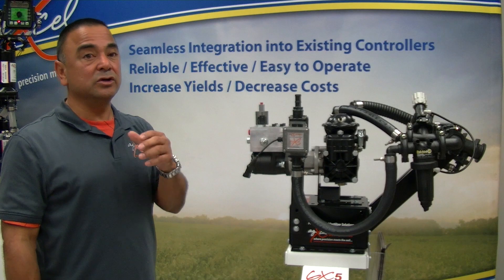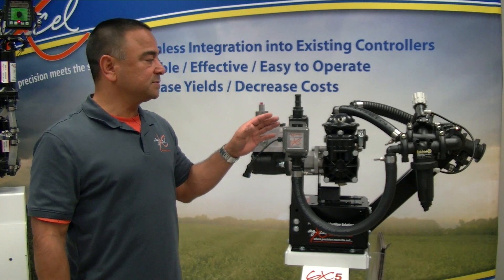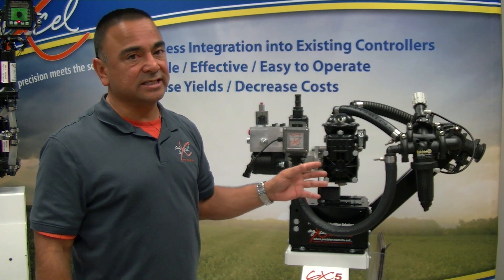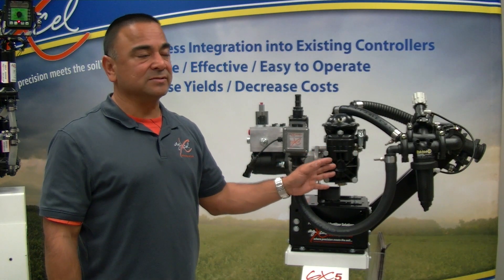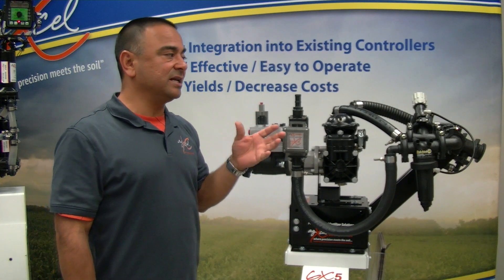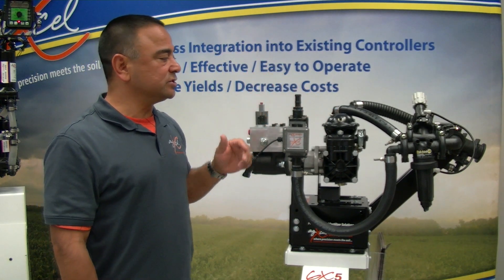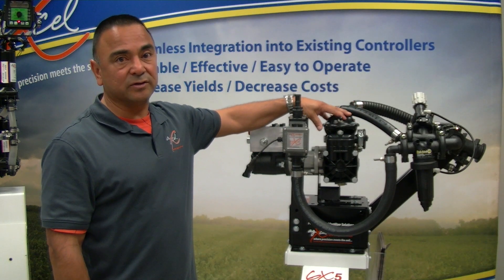These positive displacement diaphragm pumps are very low maintenance — simple to maintain. If a diaphragm goes out, the head is very easy to take off and replace the diaphragms to get back up and running. If there's ever a problem, like a leaking diaphragm, the drop in flow is easy to notice. There's an oil gauge on the side of the pump that lets you see any milkiness, indicating the diaphragms are out. Typically you can go two to three years without changing them, but we highly recommend changing diaphragms every season for good performance. We will also replace the diaphragms for you at no charge — you just pay for the parts.